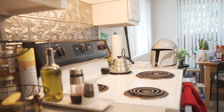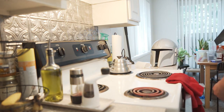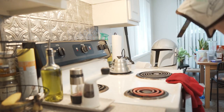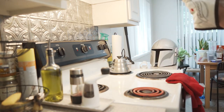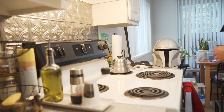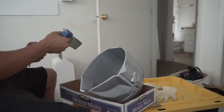I had to bend the acrylic piece into a curved shape and I don't have a heat gun, so I ended up using my stove. It works for the most part but it took a long time. My hands got way too hot so I had to use oven mitts to hold the piece. Pro tip: when you get acrylic with that little brown sticky thing on it — it's just masking tape — peel that off before you do any heating. If you heat it while the tape is on there, it transfers the glue to the acrylic and leaves a weird texture. I learned that the hard way so you don't have to.